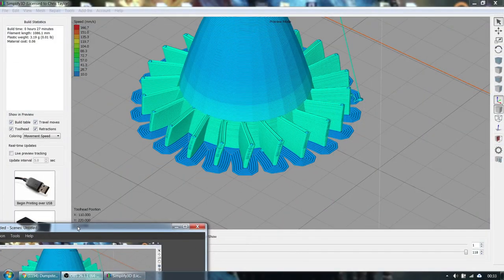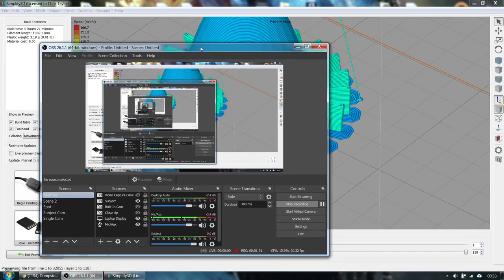The result is a really nice clean print — the top half of the nose cone without the rest of the nose cone. That gives you two separate parts with absolutely no support. They come out clean, and then you just glue your top half with the little fins on it to your bottom half with no fins.